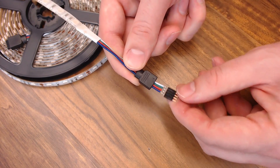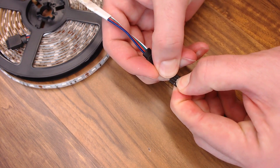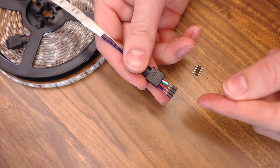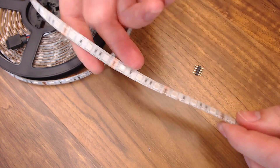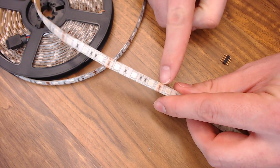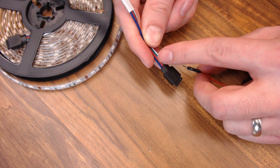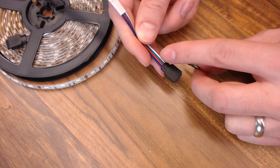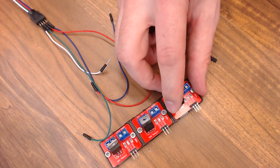Let's start with the LED strip. Mine came with DuPont connectors — there are pins in the end of this. You can take it off and use the female end, which is what we're going to do, since I'm just connecting it with jumpers for this mock setup. You can also cut these strips and solder directly to the tape on those terminals. The wire colors associate to the color of LED: blue, red, green, and then the common wire which is white. I'm just going to extend these out with some jumpers. Jumpers are on, now we'll cable up to the MOSFETs.